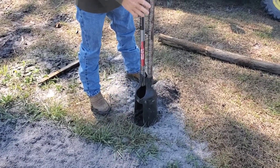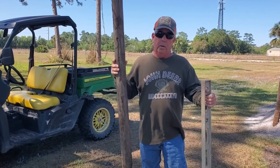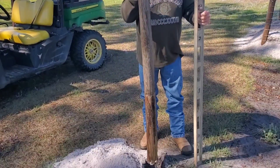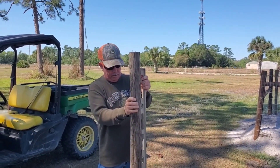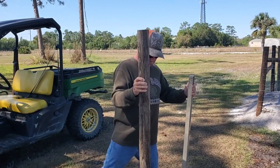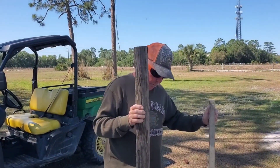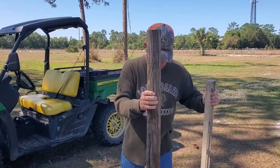This particular one has a measuring stick on here so you know how deep you're going. I've dug the hole — we just put down 22 inches, but usually you want to be at least 22 to 24 inches in the sand for a standard six-foot pole. Drop it in there and make sure it's level both ways. When it's level, you want to fill it in a little bit, then check your levelness again. Constantly check your levelness as you fill it in. Fill it in some more — you want these poles nice and straight, not crooked. Finish filling it in.